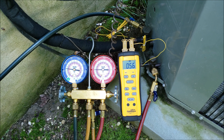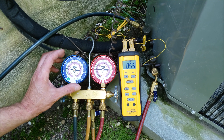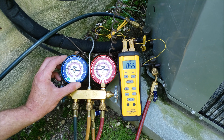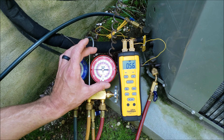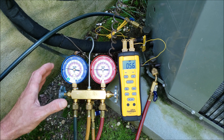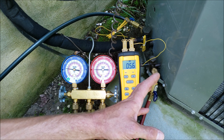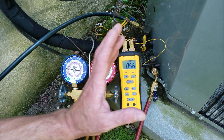I've had a lot of questions come in in reference to this — technicians are seeing other technicians just checking the refrigerant charge based on the low side gauge, and others are noticing technicians checking the refrigerant charge using the high side gauge. These are basically just rules of thumb in order to get you kind of close to the refrigerant charge level. It doesn't mean it's going to be an accurate refrigerant charge.